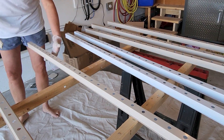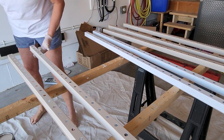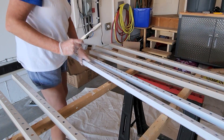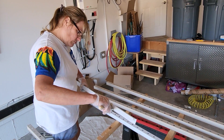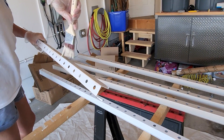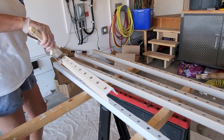I chose to use aluminum channel track purchased from Permatrack.us. This LED track was white, and in order to help it blend into my house trim, I went to my local home hardware store and bought some reasonably color-matched paint. After starting to paint, my wife observed that the paint wasn't sticking very well, so we ended up lightly sanding all of the remaining tracks — that worked a lot better. We did put two coats of paint on.